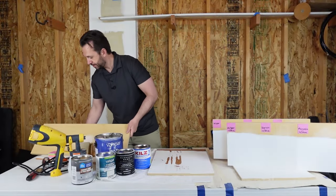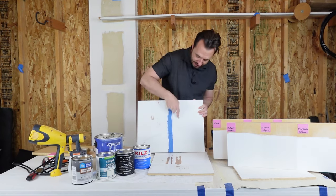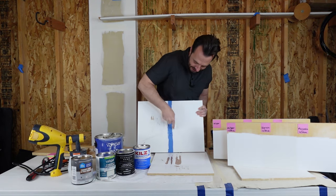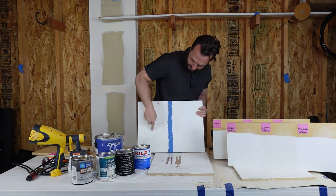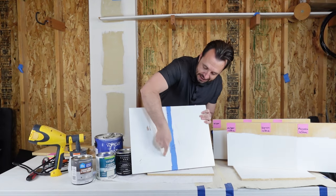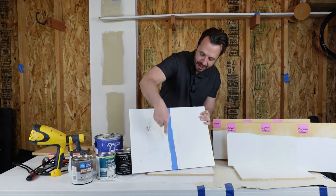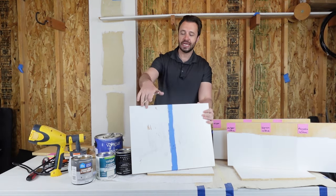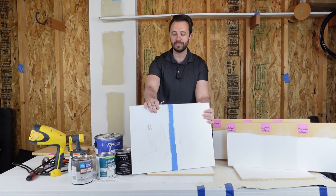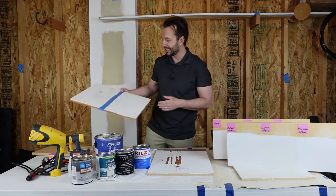Here I've got a board that I did before — I sanded both sides. With the same kind of scratch test, it is not scratching off the paint easily at all. It makes marks, but it is not scratching off the paint. In order to get the paint off, I have to really get the corner in there and dig into it. This is the Valspar oil-enriched enamel, three coats, sanded first with 120 and 220 grit sandpaper on both sides.